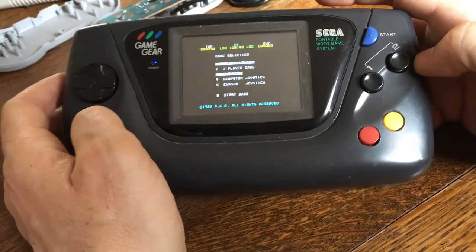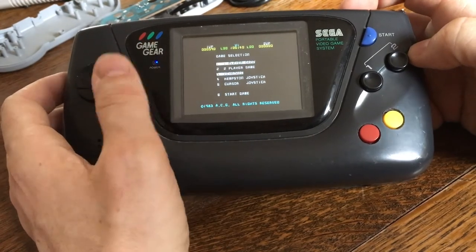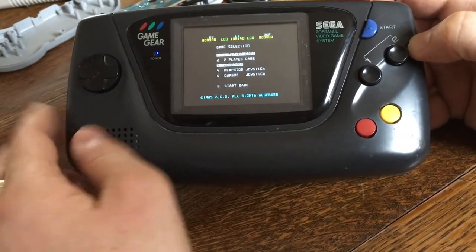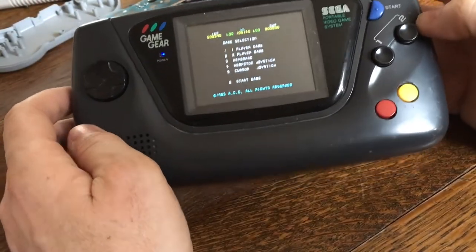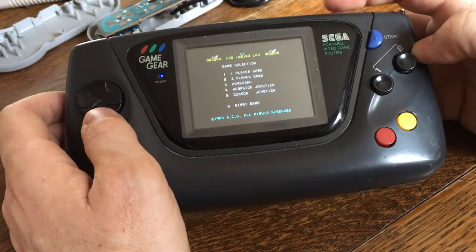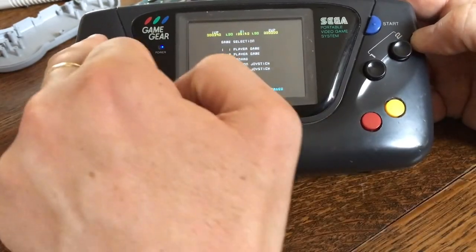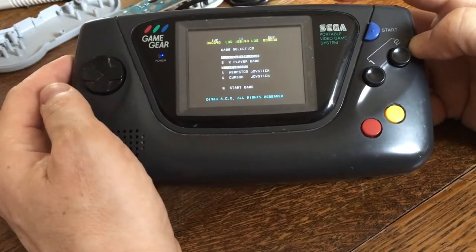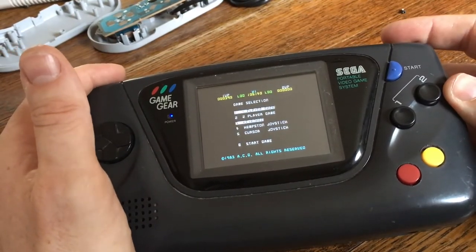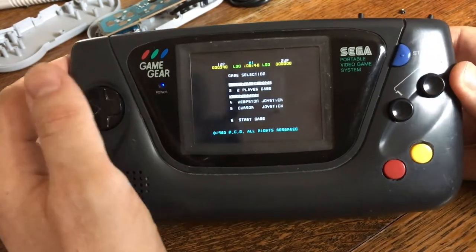And the thing about most of these emulators is that you have the choice under EmulationStation as to which emulator to associate with each game. For these little handheld builds, where the assumption is it's only a controller that you can use to control the game, you should really be looking for an emulator that starts off with LR, uses the Libretro core, and so is built to work with A, B, X, Y, up, down, left, right, start, and select, and the two paddles underneath your fingers up there. There are a lot of games, particularly Quake and things like that, where it just assumes you've got a proper computer keyboard, and on a little build like this, that's kind of impossible.